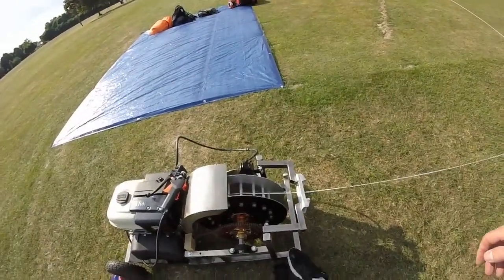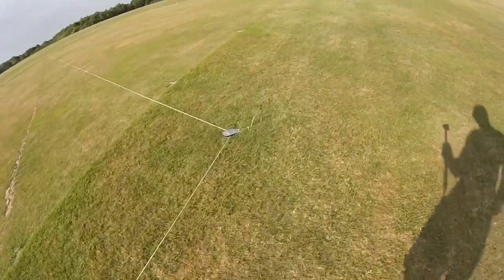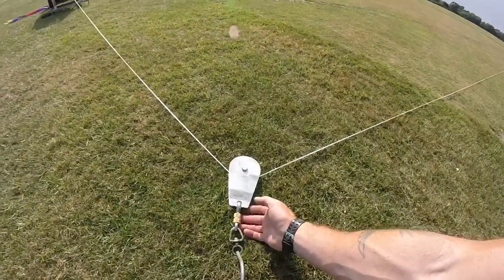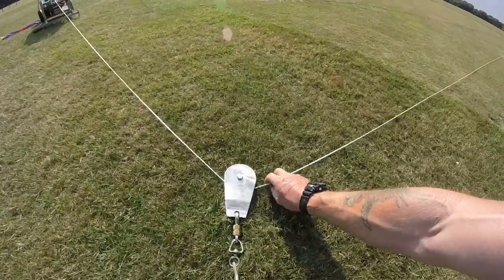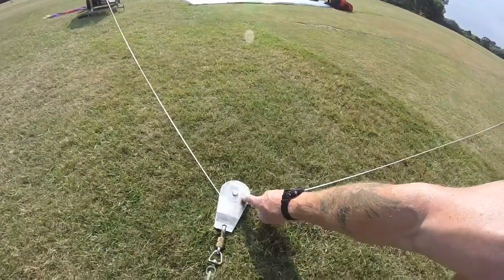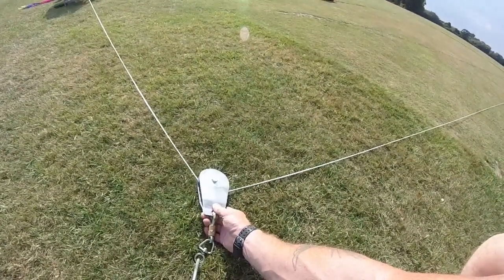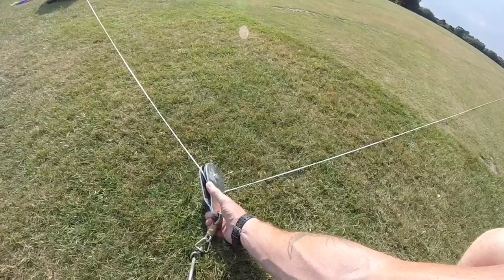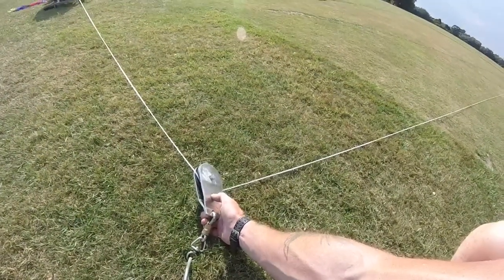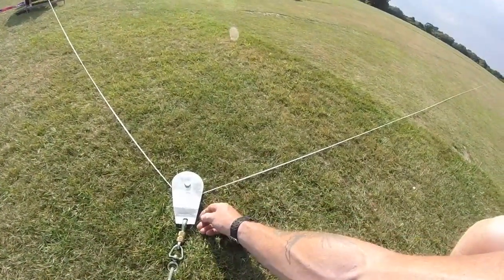Going down the line — as you can see, it's not locked down, just bedded into the ground, and it's not going anywhere because of the homemade pulley system. No matter where the pull force on the engine is, it'll be redirected through this pulley. It's a split pulley system so I can thread the cable through. The wheel itself is from a weightlifting machine, rated for 200 kilos, and it's nylon — just like the rope — to aid in less wear and tear.